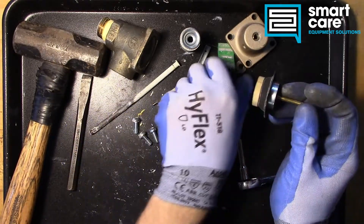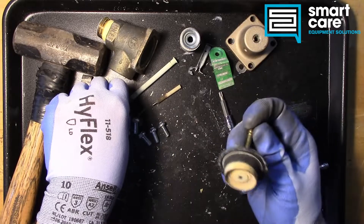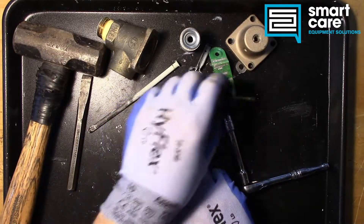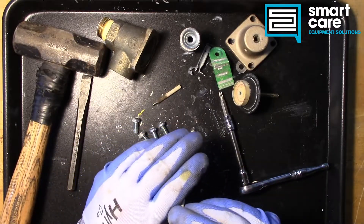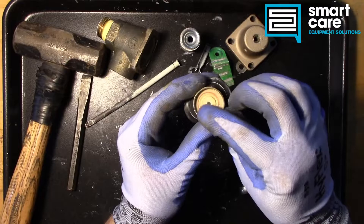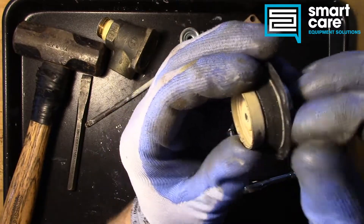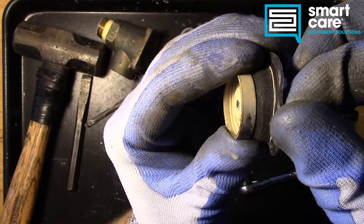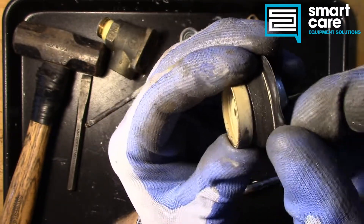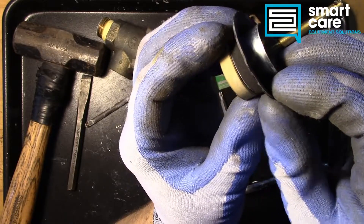The risk here is that we're so close to the boiling point of water at 210 degrees — we want to make sure that this will always open up if we start boiling to steam. So it opens on temperature or pressure. The most common failure methods are going to be pitting up here like we see in this one, where the pieces don't seal anymore. The other failure method is what we're seeing happen on the diaphragm here, where the diaphragm is starting to degrade and you can see it kind of sloughing off — it's flaking away.